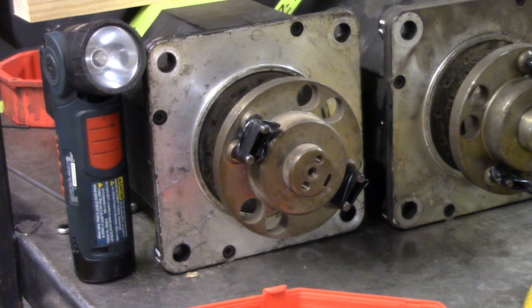Notice, if the motor slightly oscillates after move syncing or continues to move a little rough while move syncing, grab the motor shaft carefully with your hand. Move sync the motor while gently squeezing the motor shaft. If the oscillations and/or jerky movements go away after applying a small amount of load to the shaft, this is normal. This problem will not occur during normal motor operation.